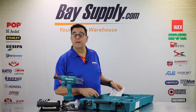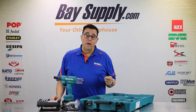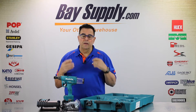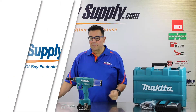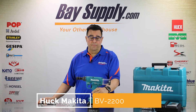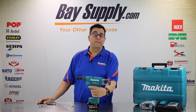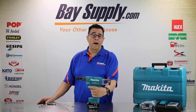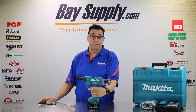Let's attach a nose assembly and we're going to show you a bobtail fastener, which is Huck's newest fastener that doesn't have pin tails that break off when you set the lock bolt. We're going to show you what bobtail is like and how it's set with this cordless tool. This tool is a baby brother to the Makita BV4500 series that we've already done a video on. This one has lower power and is primarily designed for the newer series of Huck bobtail lock bolt fasteners.